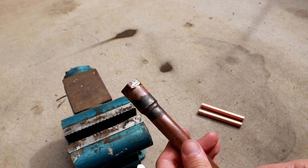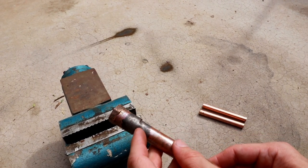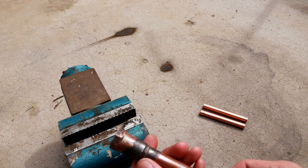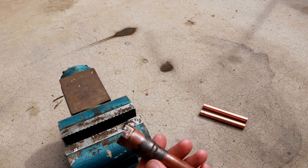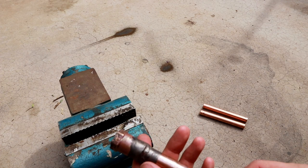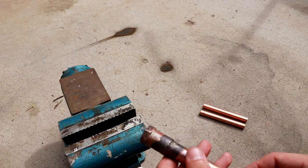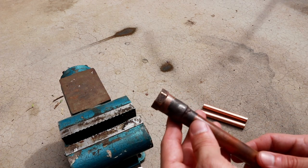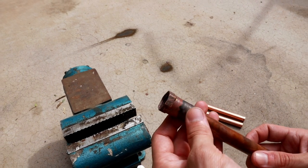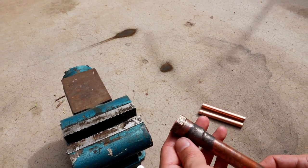This braze actually ended up turning out fairly well. It looks like fairly even coverage all around, a little bit of a drip once again on the lower side, but definitely not too much overheating of the pipe and I don't see any significant gaps or voids in the braze. Now here's a good opportunity to note why in an HVAC application you would want to flush the inside of the system with an inert gas like nitrogen — to ensure that the oxidation we scraped off the outside doesn't form on the inside.